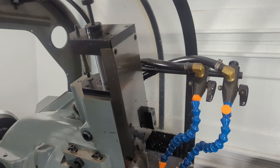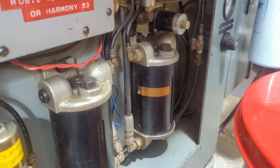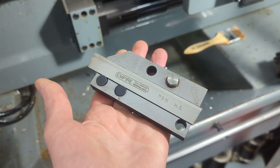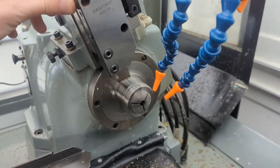The last thing I interfaced with — but am not currently using — is the hydraulic cutoff tool. It's actually a pneumatic-hydraulic system: air pressure pushes fluid to drive a piston for the cutoff tool. It's hard-mounted to the spindle and just comes in at a fixed speed to part off your work. It would free up a tool position on the turret, but I usually use my cutoff tool for back-chamfering and other operations, so having it on the turret is more useful to me. I don't foresee needing the hydraulic cutoff, but it's there if I ever run out of tool positions.